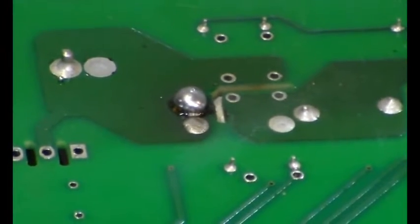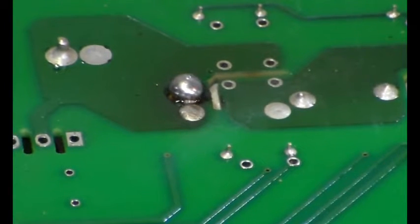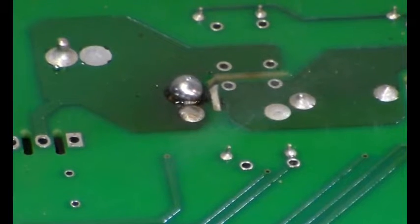That's soldered up. We spread the solder onto the cleaned areas of the circuit board, put plenty on there, and try to get it to flow down the pin from the relay contact pin. We do our best and put plenty on there. Now let's put it back together and give it a road test.